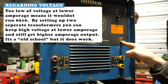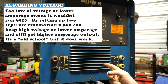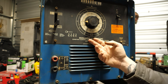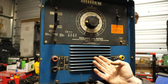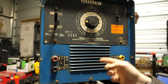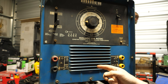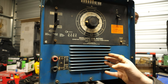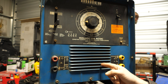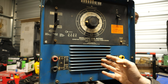This does have an overload breaker — I can't imagine what you'd have to do to actually hit that. Speaking of output, to get this level of massive output, this thing isn't very efficient. You're going to need a massive power supply. This will drain your electrical system faster than your ex-wife did your wallet. You need at least a 75-amp breaker direct-wired to this to get max output, which is pretty astronomical. A lot of us in home garages don't have that much power to begin with.